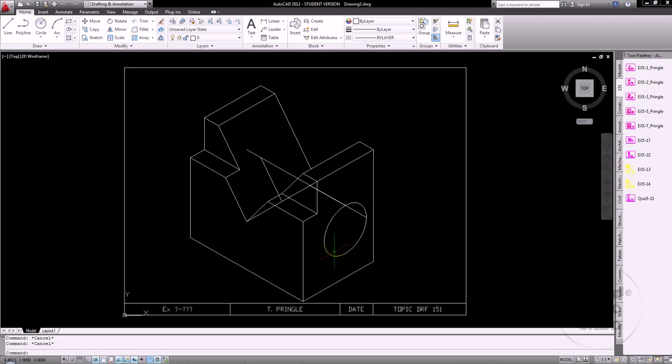The easiest way for me to do this is I'm going to project another line from here along that 30 degrees back to here. And then I'll do a new center ellipse using this, and this ellipse just does not want to work for me today. Okay, because my center is wrong. Instead of being 1.25 back, this center should actually be lined up with the center of this.